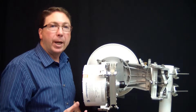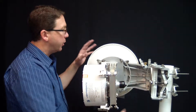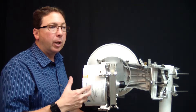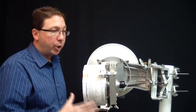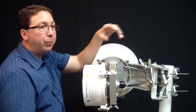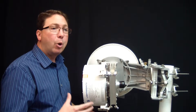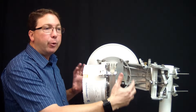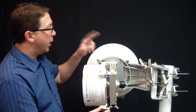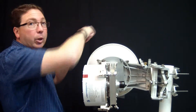This now gives you double bandwidth. You went from having a single gigabit to now having a two gig solution on the same antenna. Depending on what you're using in your network, you can do VLAN separation — only so many VLANs going across each link — or you can do load balancing or ether channel, whatever protocol you want. It will allow you to have two gig of bandwidth going across the same link, with one in horizontal and one in vertical.